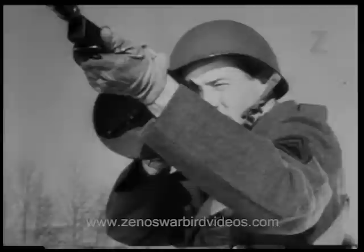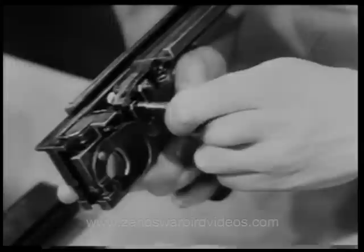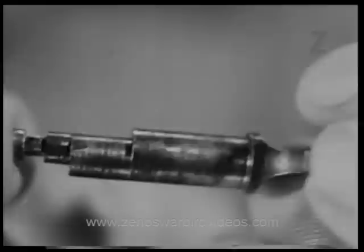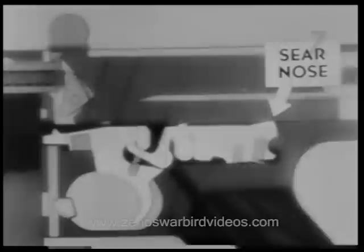With the rocker pivot in this position, the tommy gun will fire at the rate of about 600 rounds per minute — it takes five seconds to empty a 50-round drum magazine. The rocker pivot is of eccentric design. At full automatic, the rocker is low enough to allow the bolt to move forward without striking the point of the rocker. Therefore, the sear nose remains in its lowered position and the gun fires as long as the trigger is held or until the cartridges are expended.